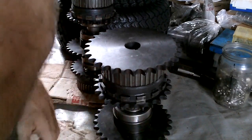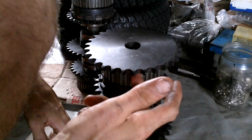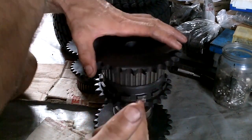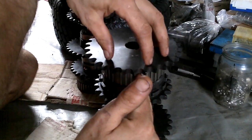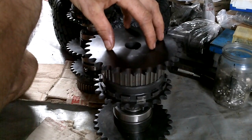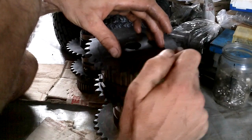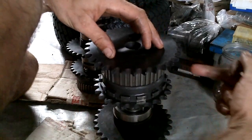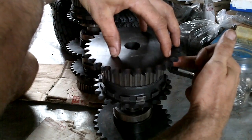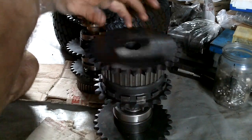You know, this could be off by a tiny amount, so if the drill compresses the rubber and moves it a bit. No, but you know what? Okay, if I drill from here, it's just going to push the gear that way. And then as soon as I stop drilling, it's just going to rebound back. So it's not going to mess up the hole. It's not going to move the hole sideways. It's just going to push in. And then when I drill here, it's going to do the same thing. So I should be fine doing this with that rubber in there.